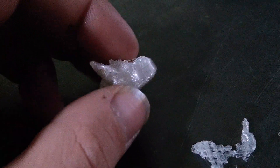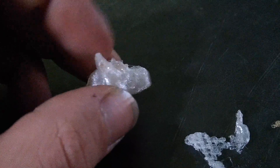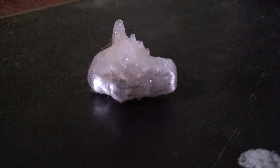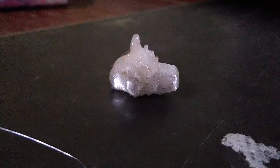I think I've got everything dialed in. I do have some retraction setting issues to deal with, as you can see from the slight stringing. This is a 100% infill TPU print — the dragon head you've seen me print several times before. This is the first time I've printed it in TPU and I'm actually pretty pleased with how it came out. It's hard to see on camera because of the light and the translucent TPU.